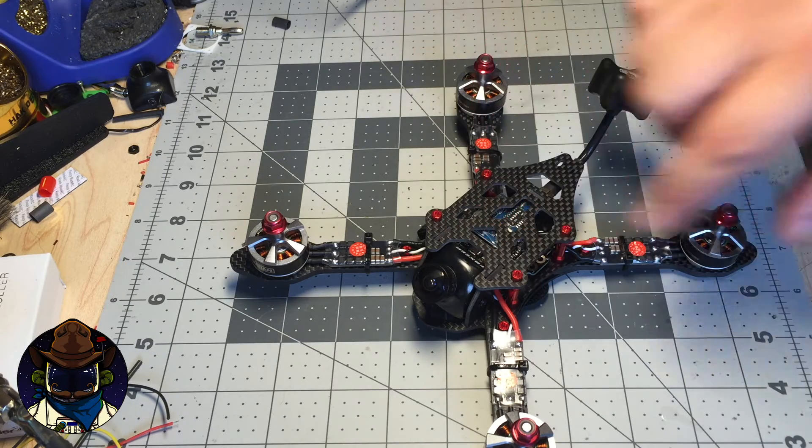That's the overall overview of the SCX 200 Low Pro. It's for advanced builders and advanced flyers. The main goal was to get the battery weight closer to the thrust line — you can also still bottom mount the battery. The kit will be marginally lighter, mostly from using the combined PDB and flight controller. If you're a hardcore racer wanting a top-mounted battery, this frame might be a good choice. I'm going to release this on Armattan pretty soon — a couple of people are testing these frames, and hopefully in another week or two I can post them so everyone can try them out.